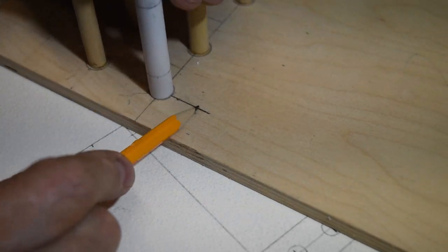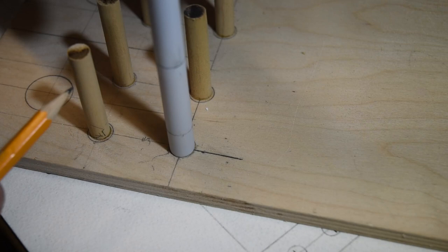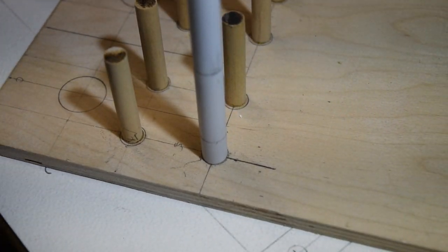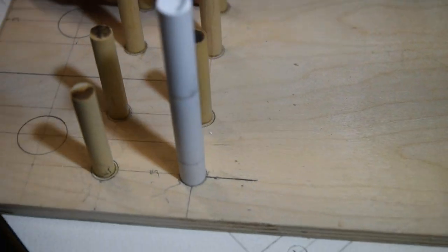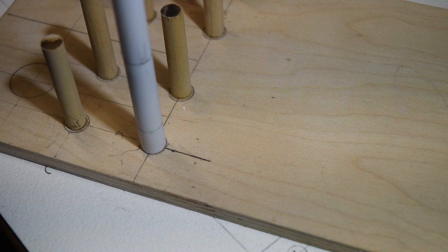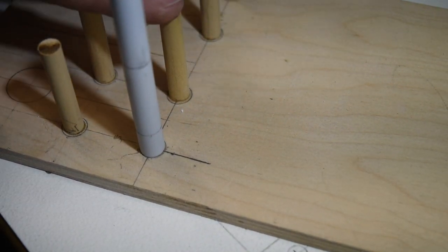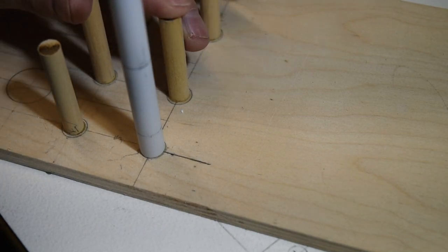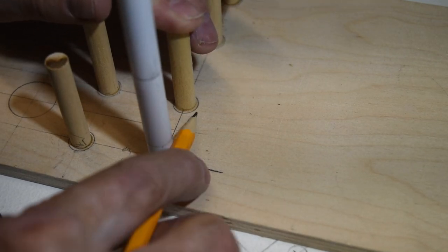Okay, so see the grid that's already drafted on this jig plate here? All these dowels are on a center line. I just drew up a simple square pattern once I decided the spacing of the poles. Once that was determined, I epoxied these dowels, which are square from a disc sander, like I showed with the jig. They're glued on there with 5-minute epoxy, and they're nice and solid. They're not going anywhere, trust me, and they don't need to be pinned.